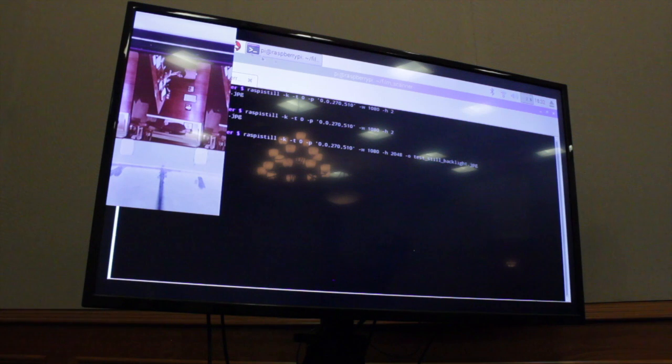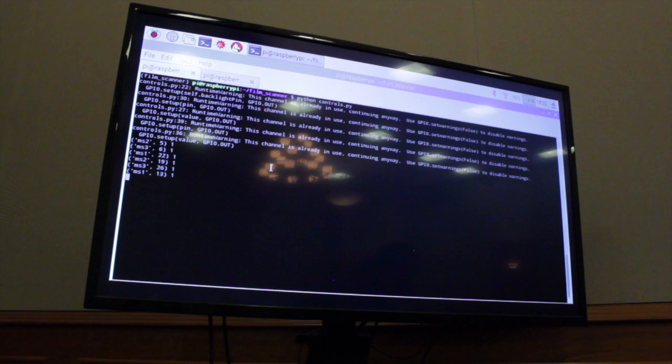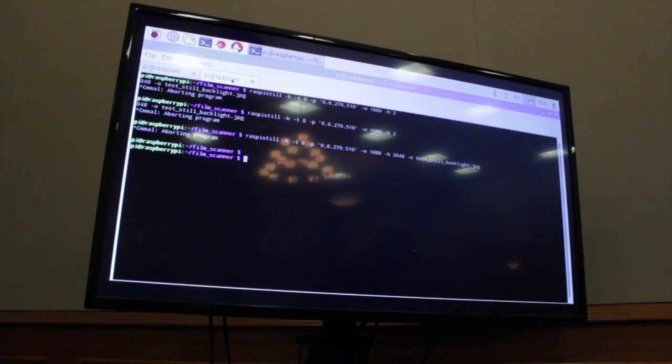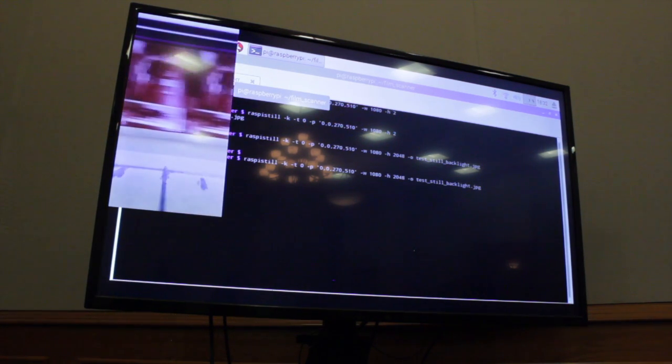Okay, let me just close that for a second. One of the problems too is if you don't tape your film down, and usually you have to tape the film down to the core, because as you can see here, it just slips. Or you need to slide it into one of the slots they've got in there. But the film just moves through like that. I've got it going now. You can see how quickly that's going through there, but it's pretty steady. Those skateboard wheels do a pretty good job of maintaining that tension